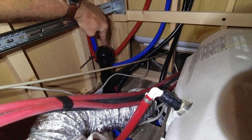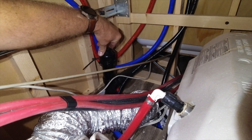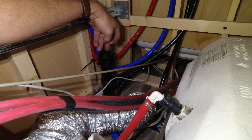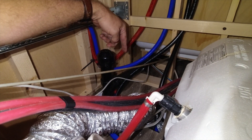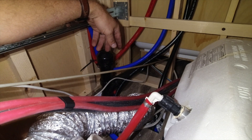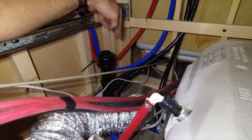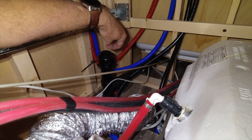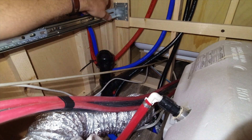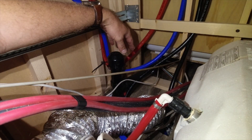This is an interesting thing — I think they call it an air gap valve. If you ever start spilling nastiness whenever you dump your tanks, or just at any time, find these — they're in your coach. There's probably one near a shower and one near every sink, and there should be one from the black tank somewhere too. In a fifth wheel they often put it down in the basement. This valve is only about eight dollars. It's supposed to allow air to flow into the tank but not back out into the coach. Sometimes when they wear out after years, it's just a cheap, easy thing to fix — only about eight to ten bucks.